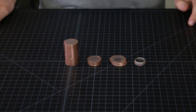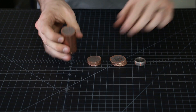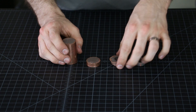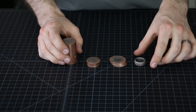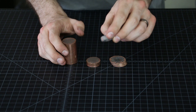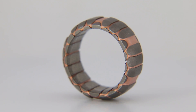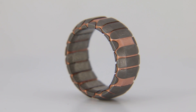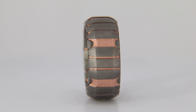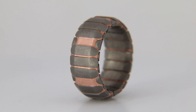So here the ring is finished. I set up just an example of all the steps we took — so we started off with the rod, then we had the waterjet guys cut us these little cookie-shaped discs, and then we cut the hole in the middle and then finished shaping it, and then did all those finishing steps like etching it and doing the rock tumbler. I think the ring turned out great. The etching we did to it was kind of an extra step that I think really adds to the final effect — it helps kind of expose the superconductor a little bit better, just to make it a little bit more interesting.